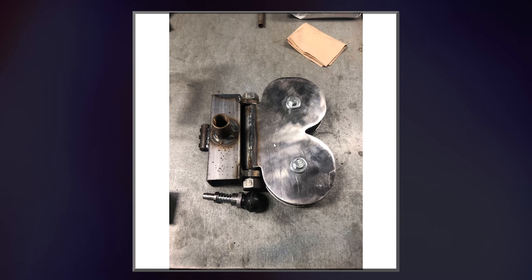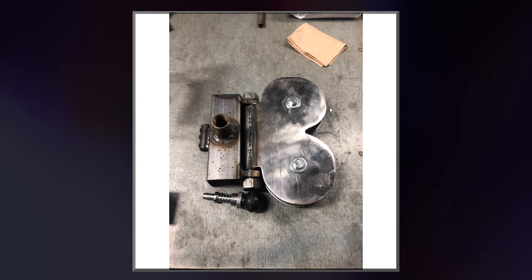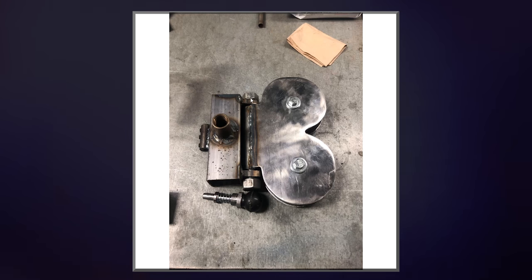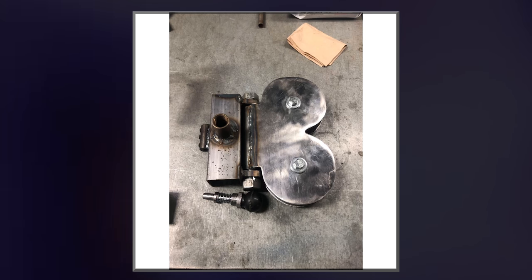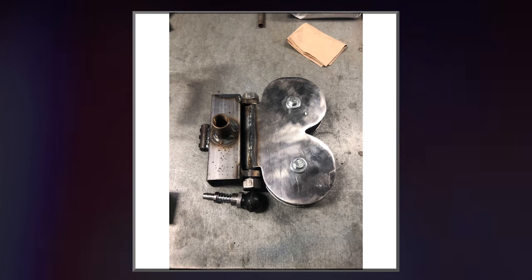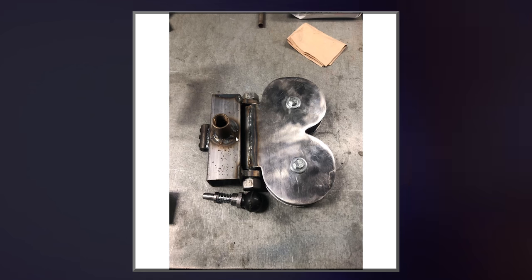So this bracket is mounted on this 3/4-inch pipe. I just welded it on here, and this is a very early picture. I cleaned all this up. It looks much better now. So it's welded onto here, and then there's a 3/4-inch bolt that is mounted onto this piece using these brackets that I just cut out of some metal that I found, welded onto there. And that allows this device, this bracket that holds the pulleys, to be mounted to the adjuster device.